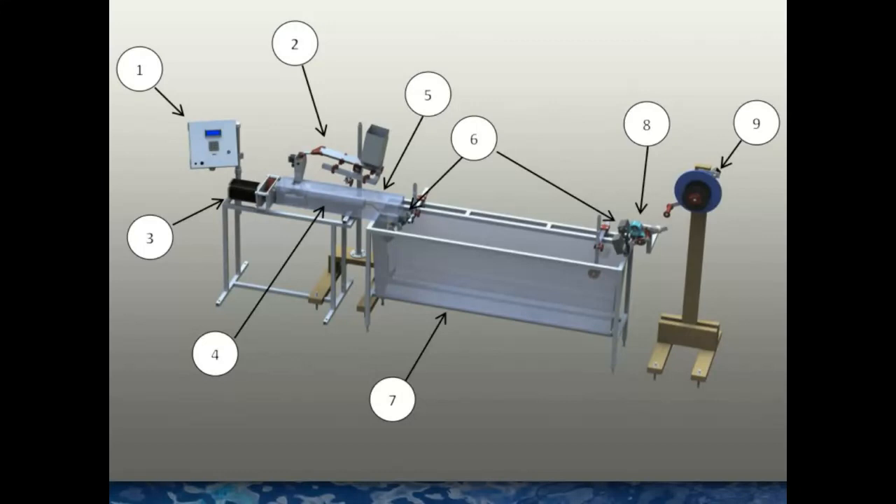Could that be addressed with a professional screw? Does that still have the grooves in the barrel? With a professional screw, the feeding zone of the screw is also designed to feed plastic more efficiently than a wood auger - which is designed to remove wood chips flowing in the exact opposite direction. So it may feed much better and eliminate the need for grooves in the feed throat. One thought that comes to mind is lost PLA casting of that auger.